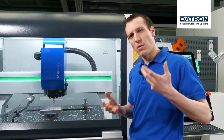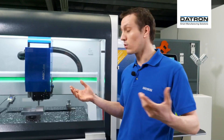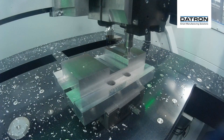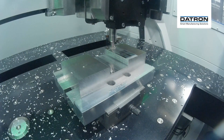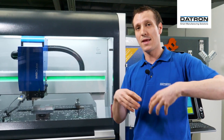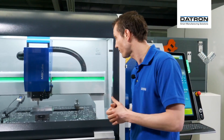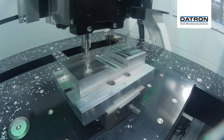Many people ask about coolant — how do you cool down the tools? There's no flood coolant here. Datron machines always go with minimum quantity coolant and we use alcohol. It basically hits the fluid, causing a temperature drop of about 20 degrees Celsius when it exits the nozzles, and then it vaporizes immediately. So it's just a clean cut. This last operation is just face milling for the following operations.